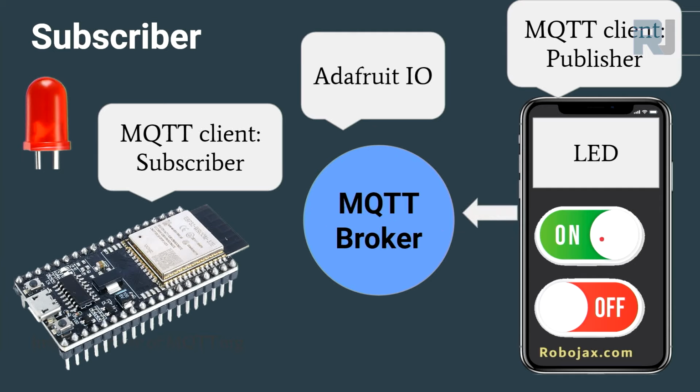So when they touch or click on an icon, on or off, the information is queued here for the LED topic. Remember, this is a topic, and we can have millions of topics. So one topic is called LED. And because we have subscribed to that topic of LED, the information comes, either high or low, or on or off. Depending on that, we interpret and read the information, and we turn the LED on and off based on the action that is taking place on the screen.